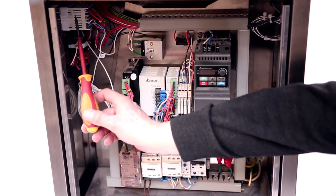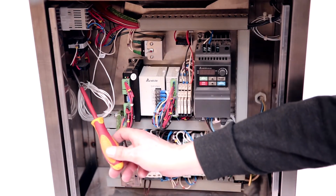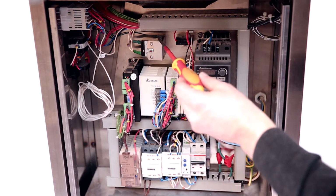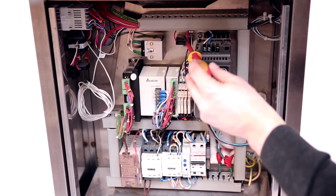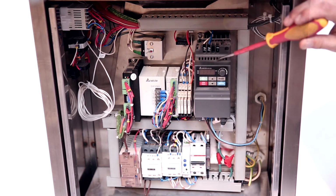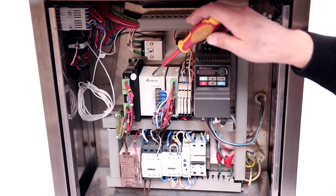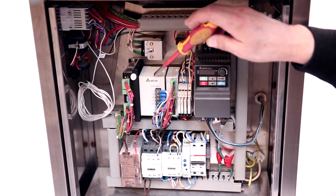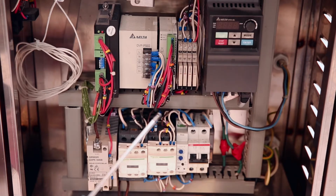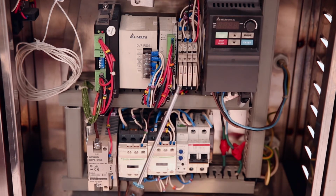In the electrical compartment to the left, temperature regulator, start button, cool down button. At the top, chamber's protective thermostat, sifter motor's capacitor, frequency converter of the chamber's motor, batcher's motor driver, power supply unit 24 volt, supplying voltage to all elements, controller, relays K1, K2, K3, K4.